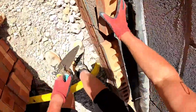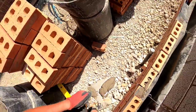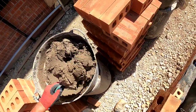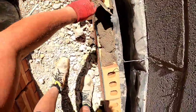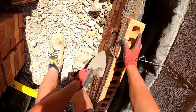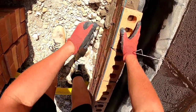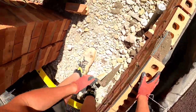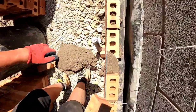So at the moment I've gone back to just carrying 10 or 12 at a time, flat, as Paul stacks them with the hod. If anyone wants to know what is the best — for keeping your bricks clean, stack them flat. For speed, if you're loading out on your own, probably brick clamps. But I'm not all about loading out at speed anymore.